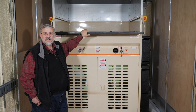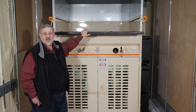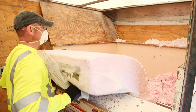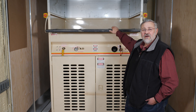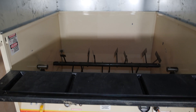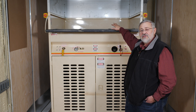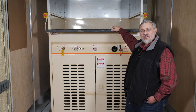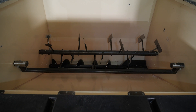Another best practice is not to overload the machine. Adding four or five bags all at once and walking away will decrease coverage because the machine will not condition the material accurately. The best practice is to add one bag at regular intervals, certainly no more than two or three bags in the hopper at a time. The hopper itself is extremely dangerous — never enter the hopper area to retrieve anything without the machine being completely shut off and the keys in your pocket. These machines can work off remotes, so never enter the hopper area until you are 100% sure the machine cannot be operated by anyone else.